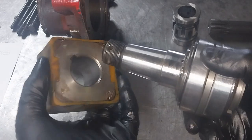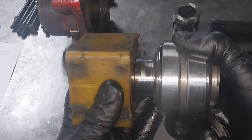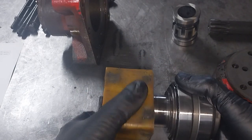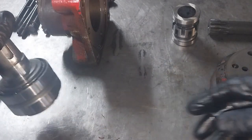Generally the output shaft on brooms has this block — there's a key, there's a taper, the block is tapered. There's a key drive, but there's also a tapered fit as well, so this block rotates and actually rotates the broom.